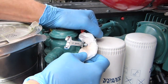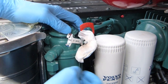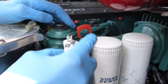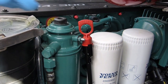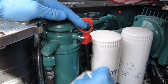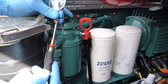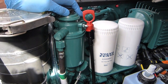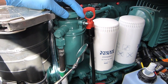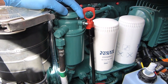Pump on this type and it's going really hard now — barely moves — so the pressure in there is really nice. As soon as we turn the starter it should fire up. Let's get that rag out of the way — not easy with everything tucked in really tight. A little wipe to make sure we haven't got any excess. A little trick I found is as soon as you fire it up, just take a mirror on a stick and work it around all the edges so you can see if you've got any little dribbles. Once it's fired and running — be careful of the belts — just have a look with the mirror, make sure you've got no nasty leaks. That saves a lot of hassle and that should be job done.